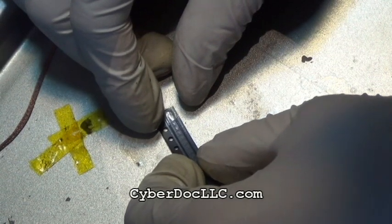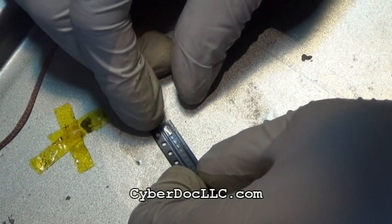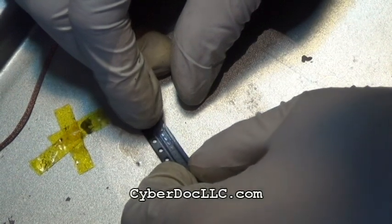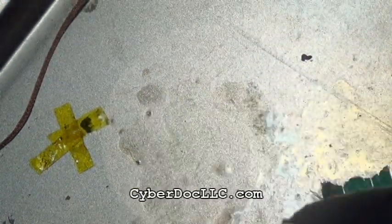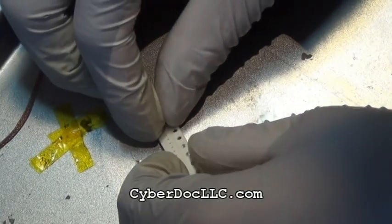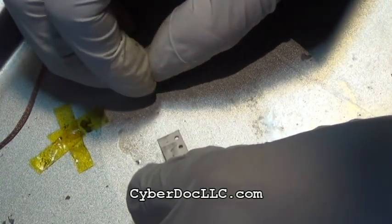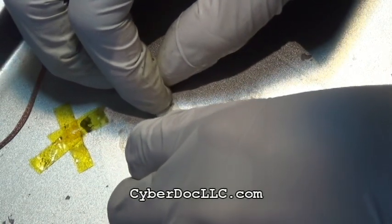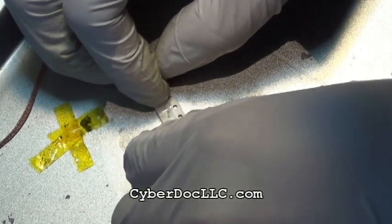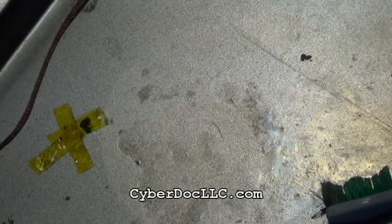Okay, anyway, so this is the iPhone 5 backlight IC. It comes in black packaging. It's very small. But it's not as small as the iPhone 5 backlight filters. You will need 3 of these for each iPhone 5. You might want to buy more just in case they fly away. They are very small. They do tend to fly, or you can do it on a magnet. Alright, so that will be all. Thank you, folks.